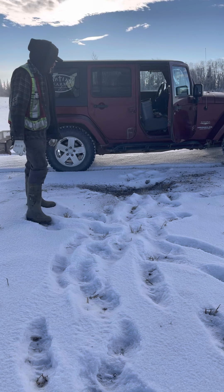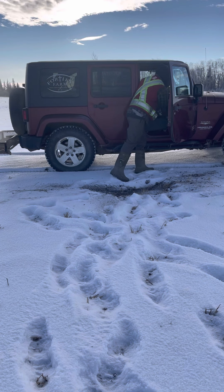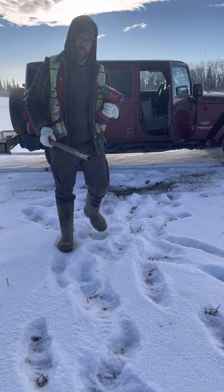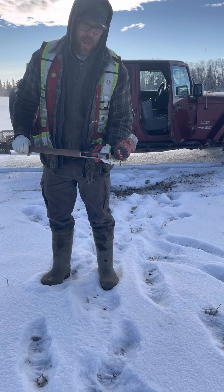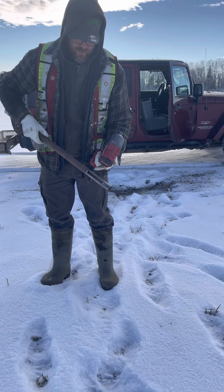Today we're going to try and do this in the frozen cold winter ground. What I did is pretty simple: I took a piece of one-inch pipe, serrated the tip as best I could with an angle grinder and a cutoff disc, and then cut two slots in it.